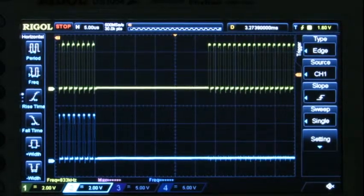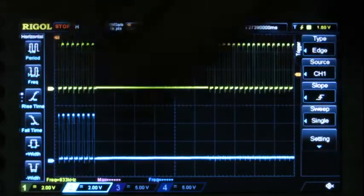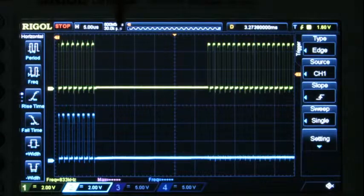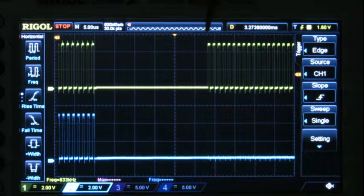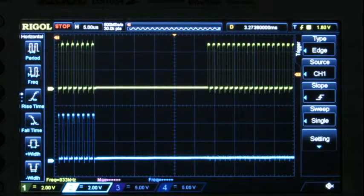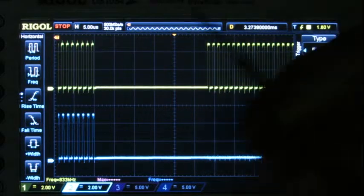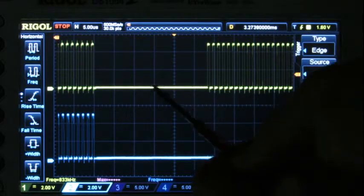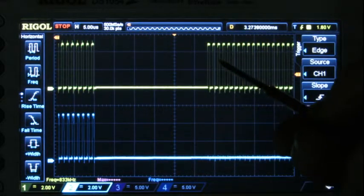Green first, blue second. Okay, here we're going to take a look at the reset time in between setting our groups of data. We got a sweep speed here of 5 microseconds. So we're 5, 10, 15, 20, 25, about 27, 28 microseconds roughly. That's about half of the 50 microseconds that's specified as the reset time. So I guess the big reset time ensures that everybody gets reset. We're at half that, and it's still resetting correctly, or loading this blanking period loads the new data into the LEDs, and so at half of the spec we're still loading the LEDs correctly with no problems.